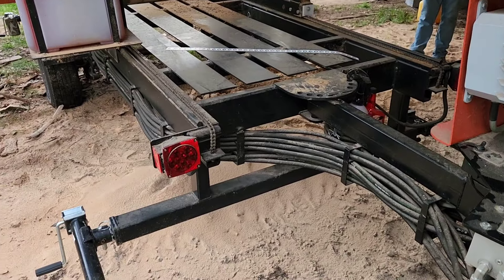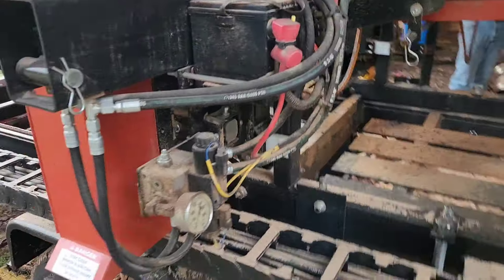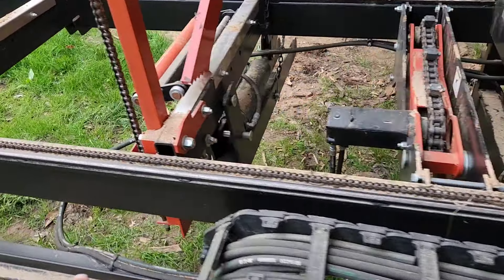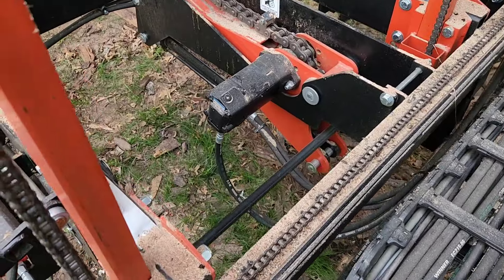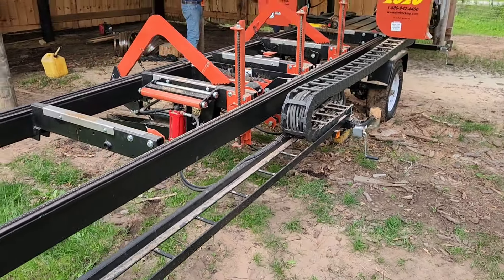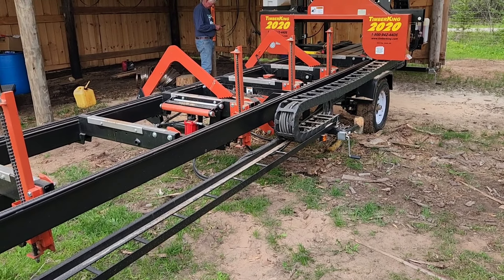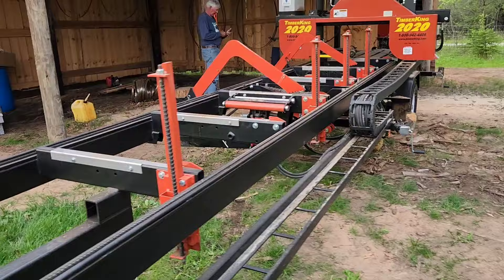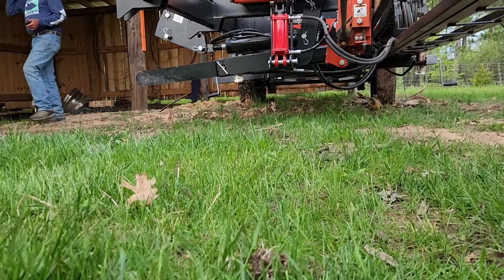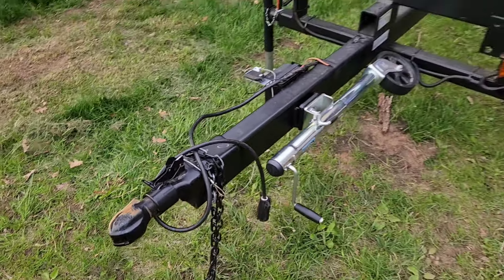We're going to check that our brake lights and everything are working — that's standard stuff. The diesel tank will stay on here, no problem. We're going to look at some of these hydraulic lines right here. If I have anything that's hanging too low, I might go in there and add some bungee straps, because say you're rolling down the road and there's an 18-wheeler tire in the middle of the road — if you hit one of those lines, you might lose one. So anytime you can bring those lines up, that's a good idea. We can see there's at least one line on the right side that's pretty low, so we'll go ahead and strap that up and then make sure we check our connections. We'll put our pin through here as well, and then we'll be safe to travel down the road.